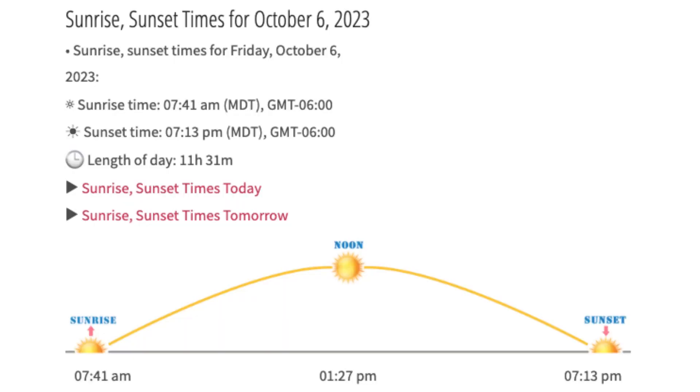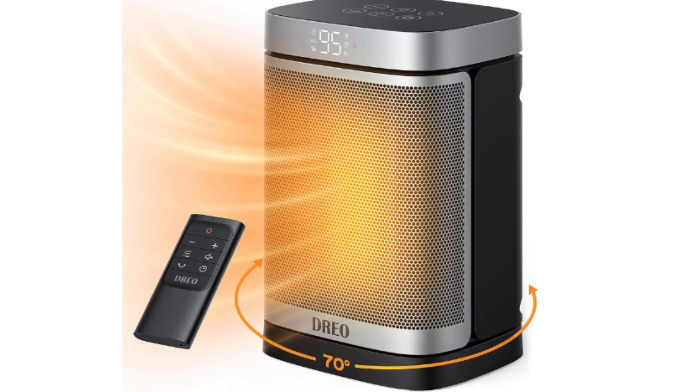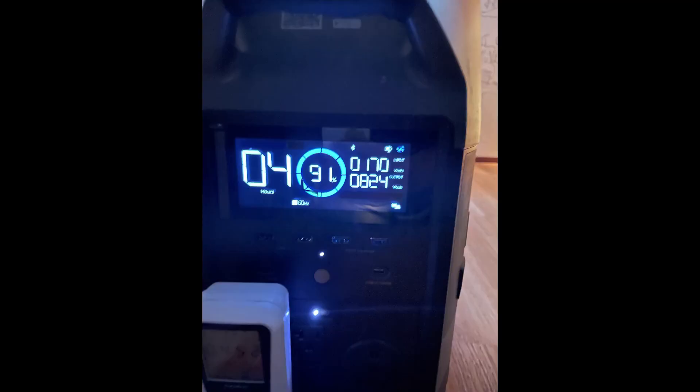I have to be honest — I was disappointed. So what did I learn? First, I did this experiment between October 5th and 6th when there's less sunlight than in June, so I would have gotten further with the battery in summer. During the experiment I ran two things I would not do in a real outage: I used the space heater for about 20 minutes, pushing the battery to around 800W of output, and I plugged in my PlayStation 4, which combined with the office computer and modem brought output to about 250W. I also worked on my laptop more to conserve the battery.